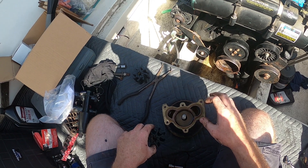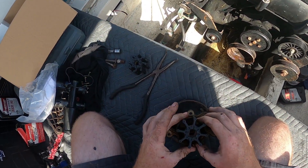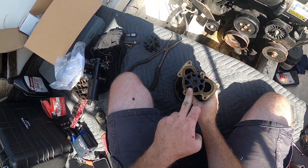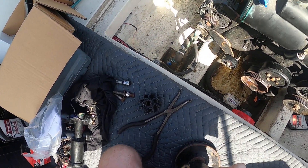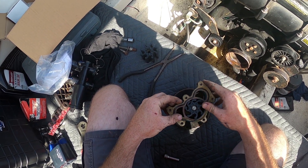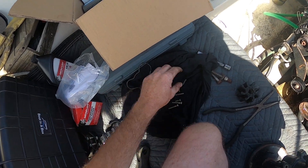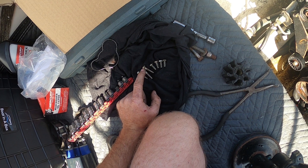We're going to put our wear plate in. You can see the direction by looking at the Mickey Mouse notch area — that little notch goes right here. To install the impeller, line up the notch of the impeller with the notch in the housing, push down, and twist the housing in a clockwise direction. As you do, the impeller will go into the housing. Only push on the impeller itself and it works its way in. Then put the new o-ring into the Mickey Mouse ears and put the housing back together.